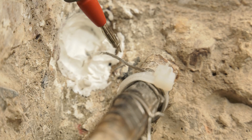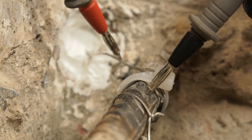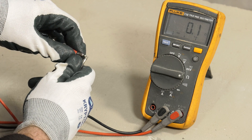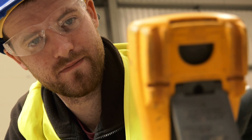To ensure a good electrical connection, the resistance between the tying point on the Patchguard anode and the reinforcing steel should be confirmed to be 1 ohm or less using a suitable high impedance meter. Check the resistivity of your meter and cables prior to use and subtract this value from the figure that is read to give a true reading.